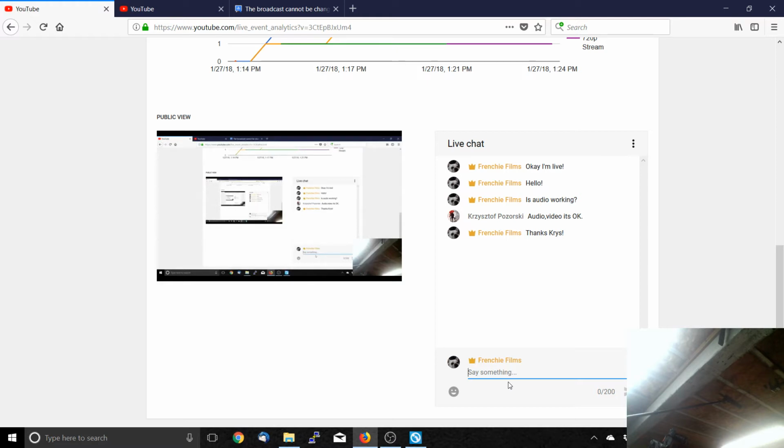Now looking at the 0.05 one, it looks like to me it's coming in from the 100K dropper coming off of the first output stage, but that 0.05 one goes over to a mid-tone. So that means that this is the mid-tone capacitor. That's the starting one here. The lower gain stage would actually be towards the plate where it's coming in, which would be up here. So I will be putting it in here. That's the first one. So that's one of those kinds of things. You can see now I'll have that black that way.